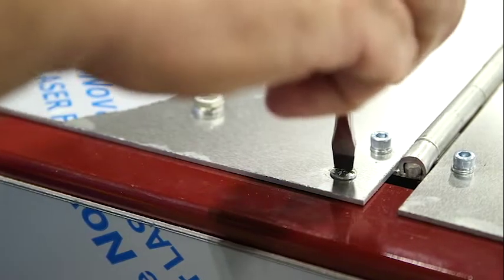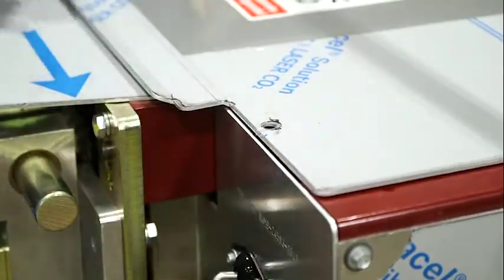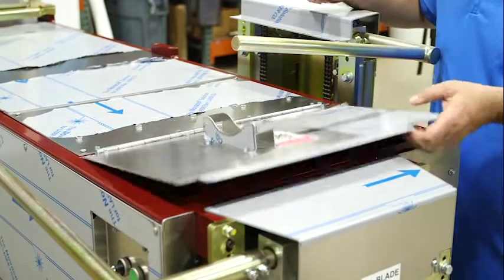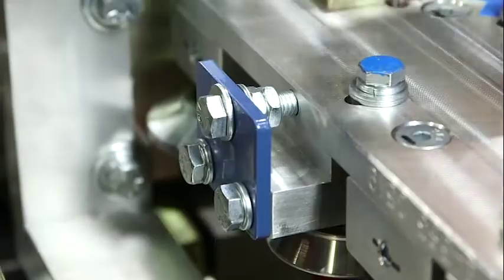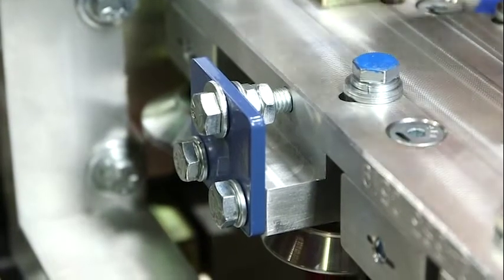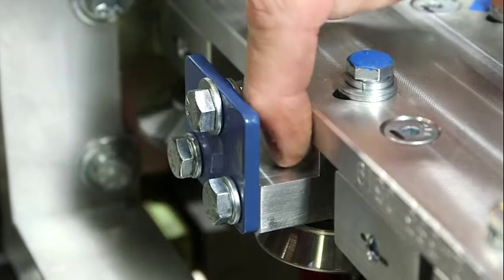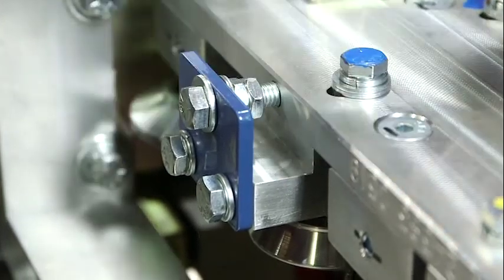Remove or open the safety cover that contains the tape holder. The blue station, commonly referred to as the swing shaft, is located underneath the cover. Check the current relationship of the blue station as it relates to the top box plate. The back vertical wall of the recessed area should be flush or parallel to the top box plate that is above the station. This is the factory starting position.